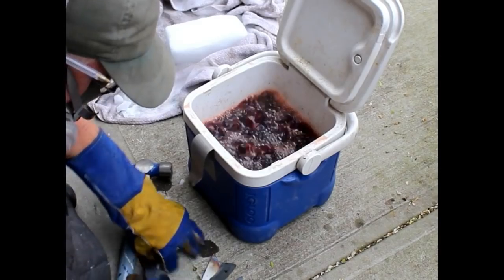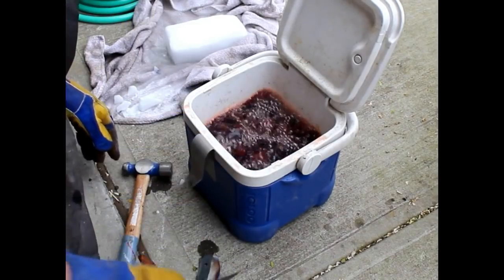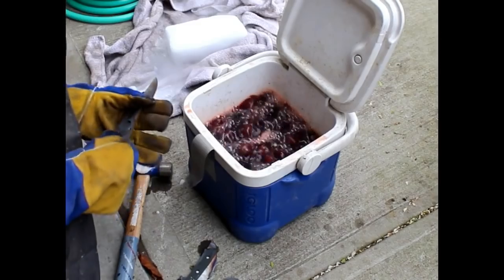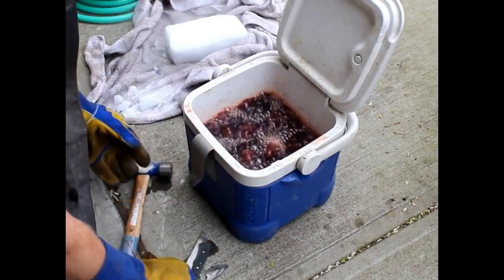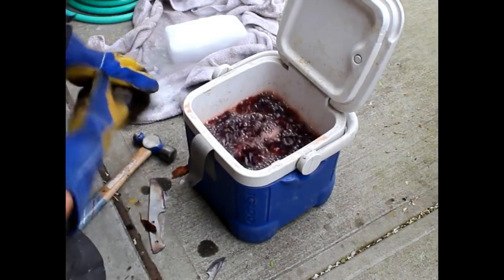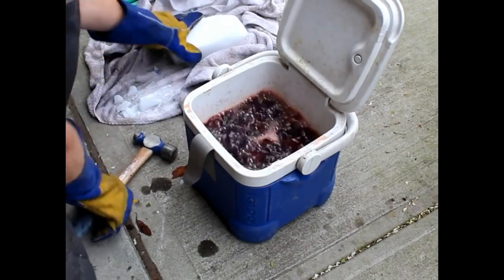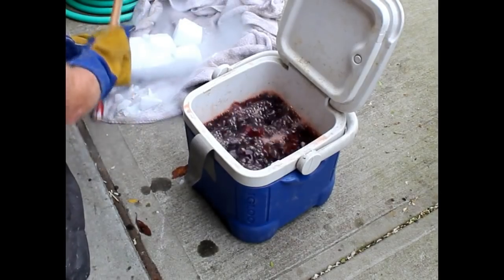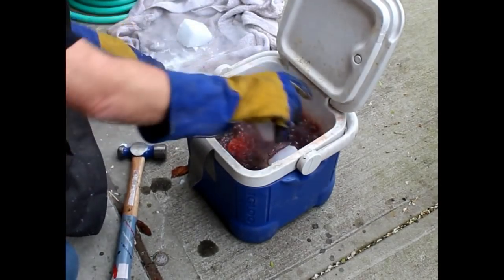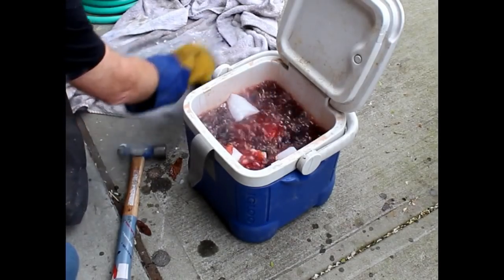Another experiment on the same video: I always did my sub-zero quench with just dry ice blocks. I was told it's good to make a slurry with diesel fuel. I may have used a little too much diesel — I added diesel fuel to a cooler and put in some dry ice in small pieces. It definitely did the sub-zero quench very nicely, but it really stunk up the place, probably ruined my cooler, and the end result was a giant frozen diesel slushy that was a real pain to get the blades out of. Unless you use a lot less diesel and a higher ratio of dry ice, I would stick with a different slurry solution for the sub-zero quench.